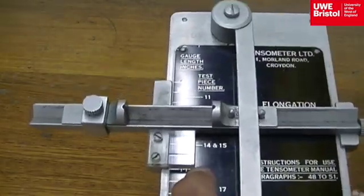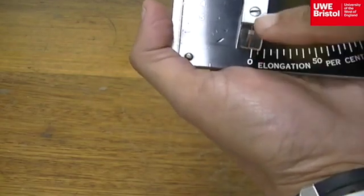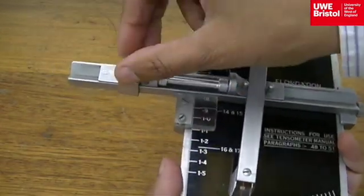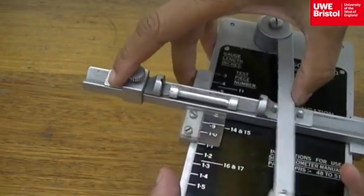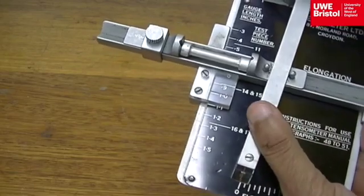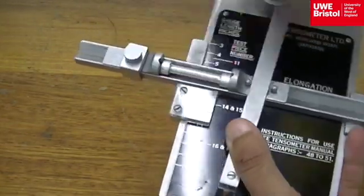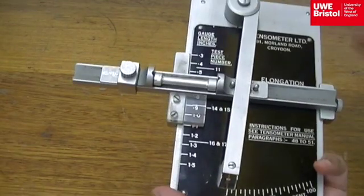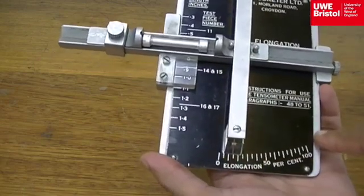The next stage is to place the specimen between the two parts, close the arm, and now the red line needs to be on zero. In this case it isn't, so loosen this screw anti-clockwise, which allows this part to move and close. These two halves have to be closed so the specimen reads zero on the gauge. Once held closed on the zero and up against the specimen, tighten that screw. Now the gauge has been set at zero for this particular specimen for once it has been fractured. At that point, closing the arm will result in it moving across the gauge and indicate the ductility in percentage.